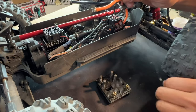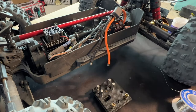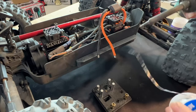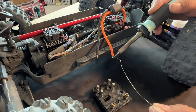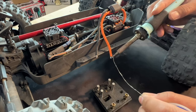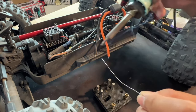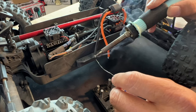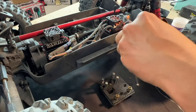You also have to pre-tin your wires. To pre-tin the wires, the first thing you need to do is heat up the wire first, and then once it's properly heated you push the solder into the wire with the iron. Another important technique: when you have a fresh soldering iron, put some solder on it and tin it a little bit to get some liquid on it — that allows it to transfer heat. A completely dry iron is not good at transferring heat.